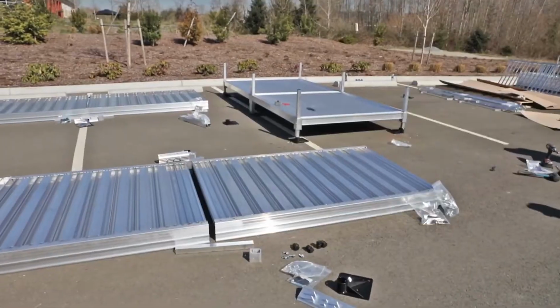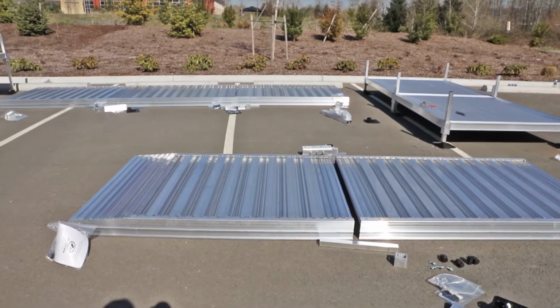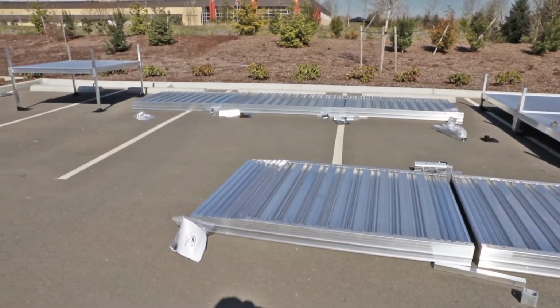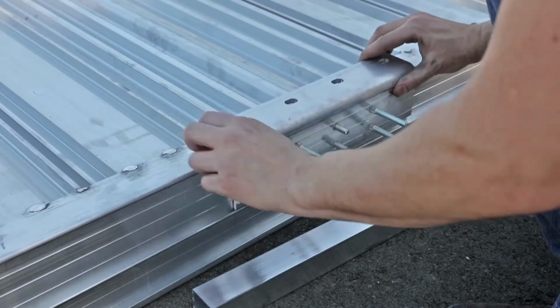Every Pathway HD system has a starter ramp that features a tapered section for transitioning to the ground. It is the first ramp at the bottom of a system and connects to the subsequent ramps in the ramp run. To create a ramp run, butt the two ramp sections together end to end, ensuring there is no gap.